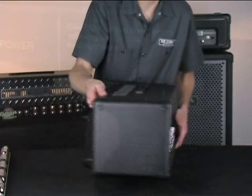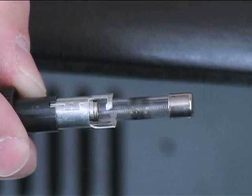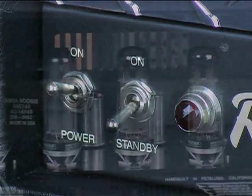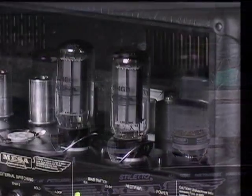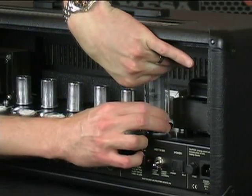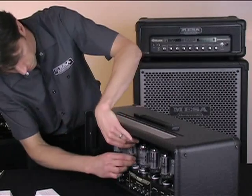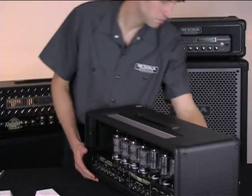Now let's get into some troubleshooting techniques. What do you do if a fuse blows in a Boogie? First thing is not to panic — the amp did not blow up. If a fuse did blow, it means the amplifier is protecting itself, and that's what it's supposed to do if a power tube or a rectifier tube might be failing. These simple troubleshooting techniques will allow you to quickly find which tube is causing the fuse to blow. Once you locate which tube is causing the problem, the solution is simply to replace the tube. Changing a tube is as easy as changing a light bulb.